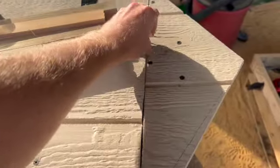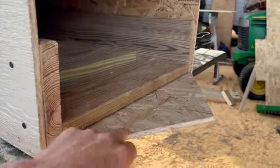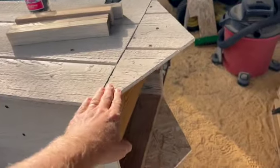All right, well, I put on this little piece here to be the other side of the gable. First thing I had to do was straighten out the cut here at the top of the door. So I made that level. And then I just put a small piece of backer here to give it plenty to chew into. And now I'm just gonna run a little bit of framing around the sides before just capping it and then putting the metal roof on.